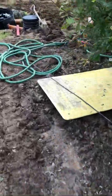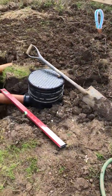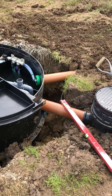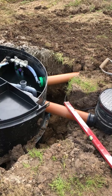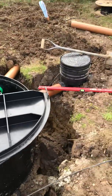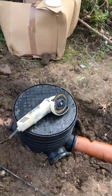The ground falls away anyway down here, which is hence why we kept it high. It goes in there — that's 50mm finished on this side, 50mm above ground level. On this side it's obviously about 300mm out, so you can see how much it falls. The ground, even though it doesn't look like it from there to there — there's our outflow.